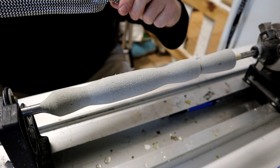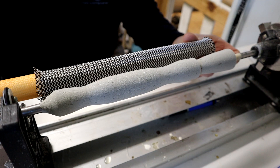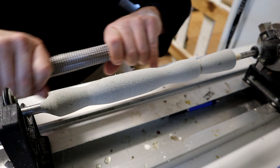Using the pre-made tube allows me to put the sleeving on before I glue it up. I can straighten the sleeving out and make it look basically perfect, so when I finally put the epoxy on it will come out perfect. You see the bends in there — you just push it together and straighten it out. This will make sure you don't have the carbon fiber going all over the place once you cinch it down on the epoxy, because once the epoxy is laid down and you put this stuff on, it's not moving.